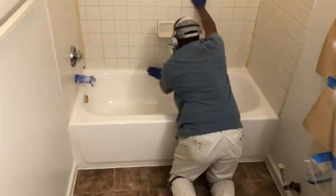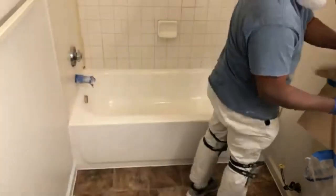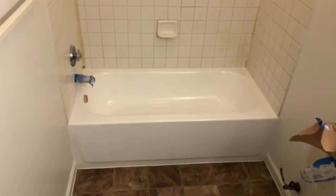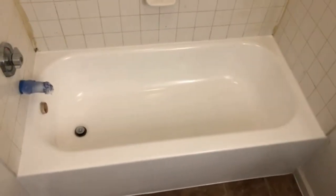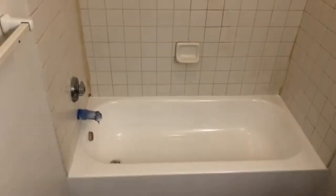Just like that — I've etched, prepped, primed, topcoated, and caulked a tub. I'm pressing down that little edge at the caulk line in case the tape pulled it slightly off the wall. That's pretty much it, all done and cleaned up. That took about two and a half to three hours and that is a $400 tub. I don't know anywhere else where you can work and make $400 in three hours. Every now and then you might get a tough tub that takes five hours, or an easy one that takes two, but that's the norm. Thanks for watching — come back and check out more videos.